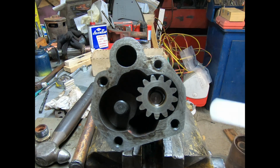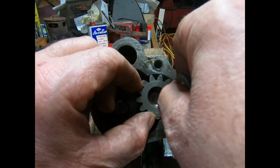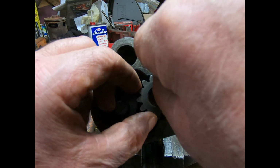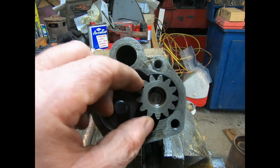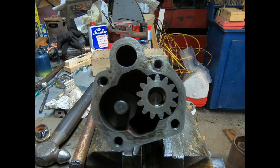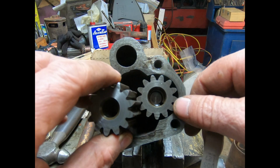Okay, so I did a little bit of dubbing off camera just to spare you the agony of it. That's a 5 thousandths. I don't know if the 6 would go. That's pretty stiff. I would say by the feel of the drag, right where it needs to be. I think I hit it dead on. And yeah, it sets down below the top, which it should.